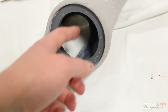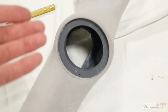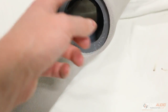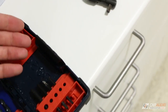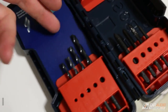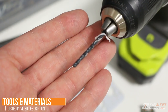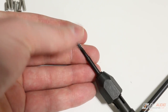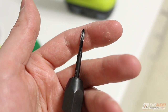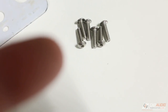I've made my speaker rings out of acrylic, which allows me to drill and tap each of the holes to secure the speaker to the ring with fasteners. If you're not familiar with drill and tap — we have drill bits and tap tools. We drill the hole first with the drill bit, then use this tap tool which actually cuts the threads into the acrylic so we can apply the screws.